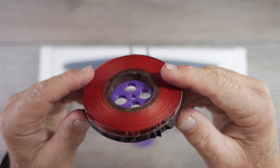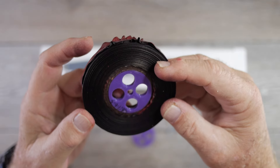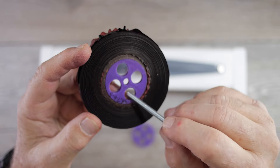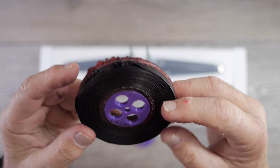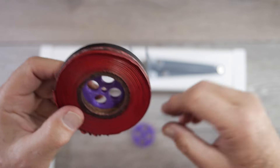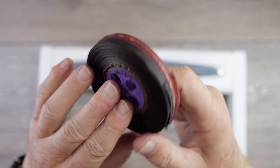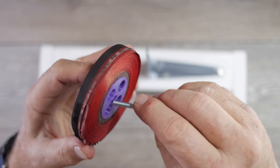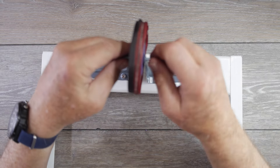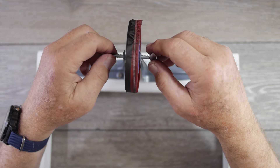The center hole of the Bako ribbon spool is 38.7 millimeters, so that's the diameter I printed these little inserts at. The insert has a 6mm hole for the bolt. The four little holes on the sides are just to make it print quicker — it doesn't need to be solid. It's only 5mm thick, so I printed two of them since it's quicker printing them as separate pieces. Each one goes in the side, and then it turns nice and even on the bracket — quite nicely. It should work great for dispensing ribbon onto individual ribbon spools.